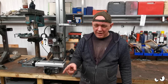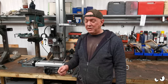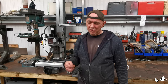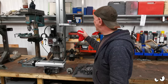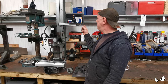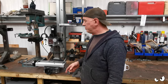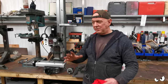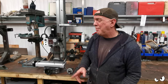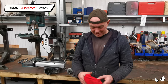The final thing is the backlash in the lead screws — there is quite a bit of it. Originally I was trying to do it all manually using the increments on the feed wheels, and trying to manage backlash was just a nightmare. Hence I stuck a DRO on it. As soon as I did that, it was easy to hit dimension — so much easier. That one goes down to 5 micron resolution; the scales are down to 1 micron. As soon as I did that it was just night and day. So it is being sold with the scales for X, Y and Z axis, but you're not getting the display unit — I'm having that and sticking it on my new mill, because I've worked out how to use it now and I quite like it.